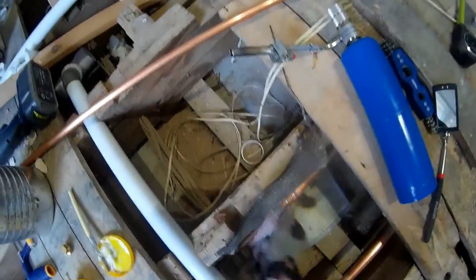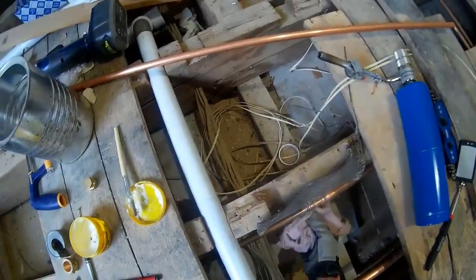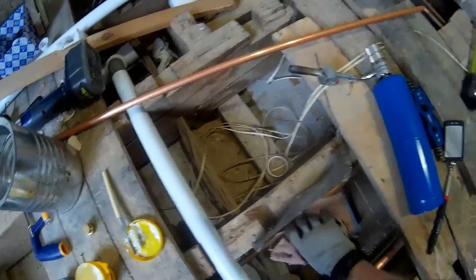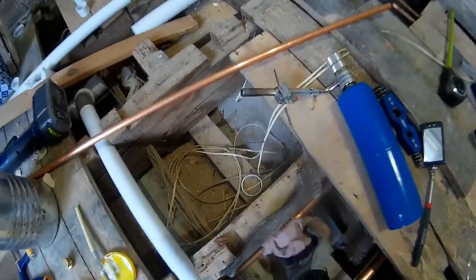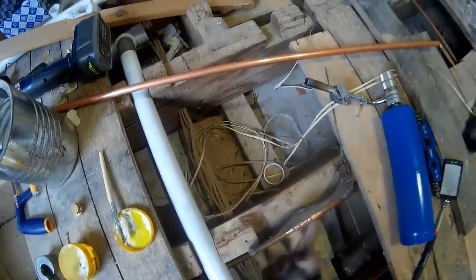Right. Always, always, always clean your flux off, especially with dirty, mucky water you found in the plasterer's bucket. It's the best water to use. Because we don't like leaving flux on pipes because it'll eat into it, even if it is self-cleaning. Self-cleaning my foot. If it's self-cleaning, how come all the bloody fittings are all green when I come back to them? Burns away. And it's as easy as that.